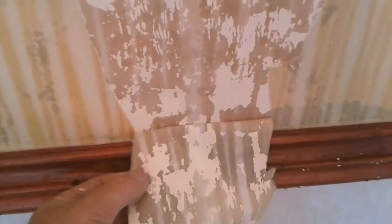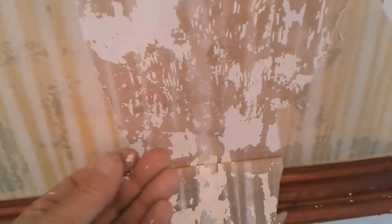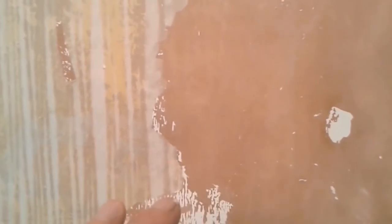This will be an ordinary contract matt. When it was applied to the wall more than likely it's not been thinned off — which is not necessarily the fault of the painter. That can just be down to pressure, the fact that these places have to be turned over really quick so you just get your stuff on and you're off onto your next plot.